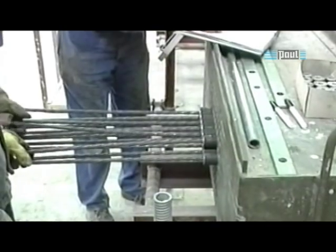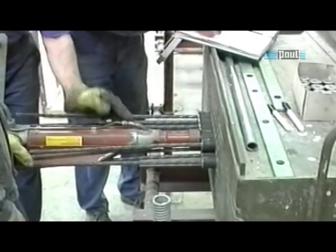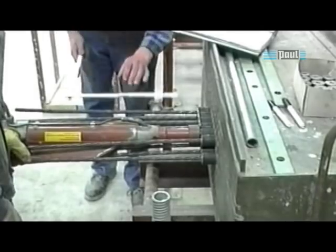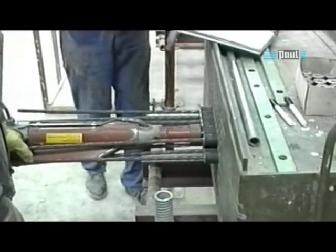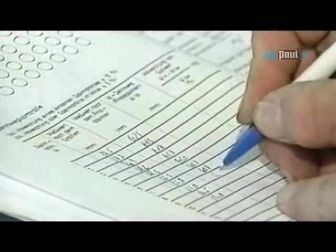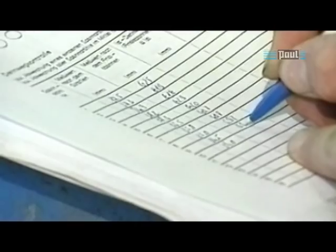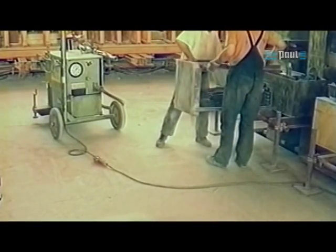The pre-stressing operation is started with one of the two push buttons in the stressing jack handle. The strand is automatically gripped and tensioned up to the set oil pressure. If the steel elongation is greater than the stressing jack stroke, another stressing operation can be initiated. The elongation is measured and recorded for checking. When all strands are tensioned, protection devices are applied.